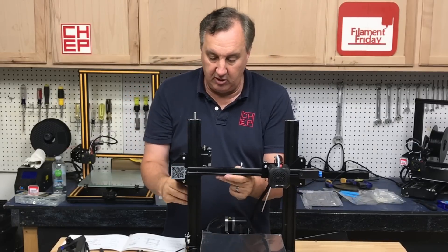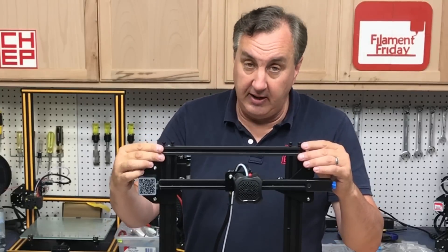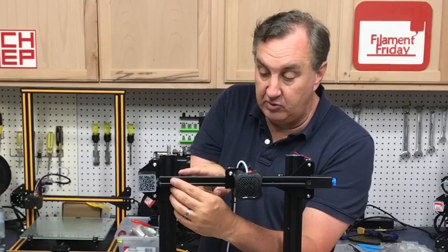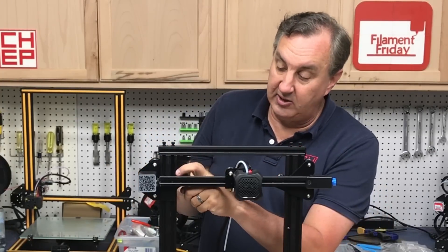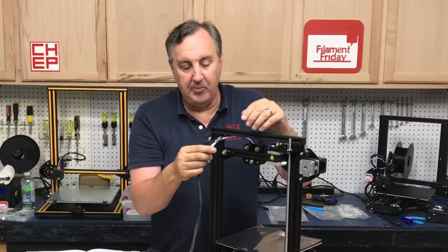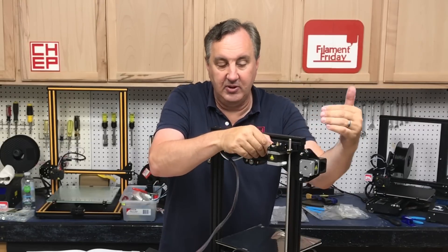Bring the assembly all the way up so it's spaced nicely, then put the top bar on with four screws. Once the eccentric wheels are tight, check the distance between the bar and the cross member — it should be equal on both sides. If it's off, slide things back and adjust the bracket screws to shift the arm until it's parallel. Also make sure your wires and PTFE tube are under the bar, not on top of it. Push the coupling onto the PTFE tube, put the little blue lock on it, and hand-tighten it in place — I don't fully tighten with a wrench since I often need to unscrew it to feed filament.